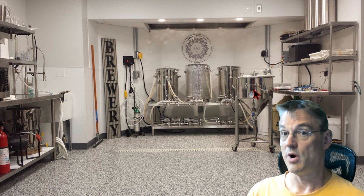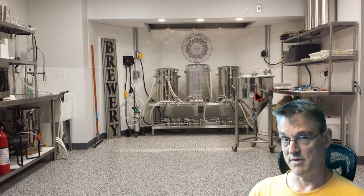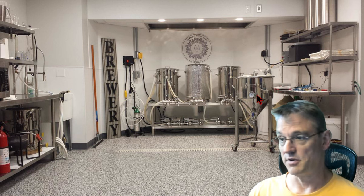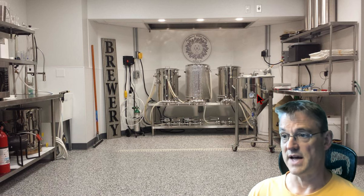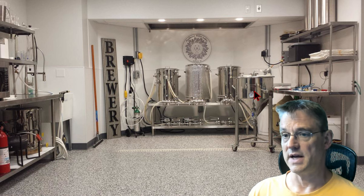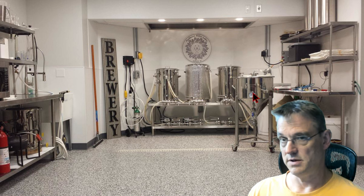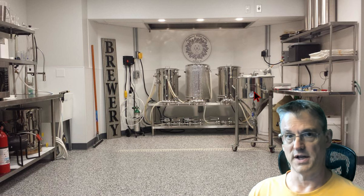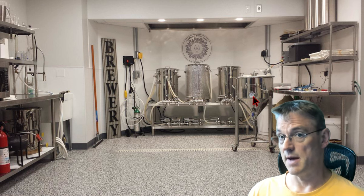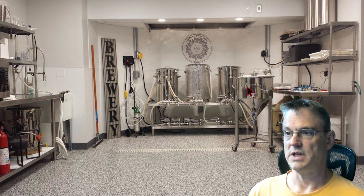Once fermentation is complete, you want to make sure everything is super clean — that's the whole point of this project. The pump cart I'm building is not to move beer between vessels; I have other little pumps for that. I want to use the pump cart as what's called a CIP — Clean In Place — pump. You can use chemicals and hot water, caustic or acidic cleaning solutions. Basically you need a pump that can stand up to aggressive chemistries and temperature required to clean these vessels.